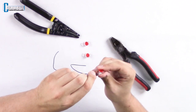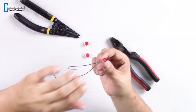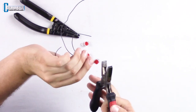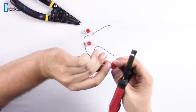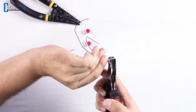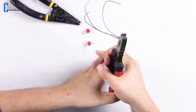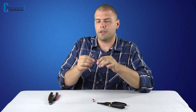Simply insert fully into the small holes here — one, two, and three cables. Use a pair of pliers to press the button, which will activate the teeth, as well as activating the gel that's inside the connector, so that it is going to be waterproof. Clamp down fully, press toward the center of the button, and it creates a secure connection like this.